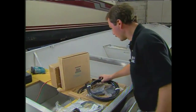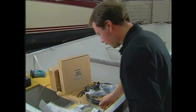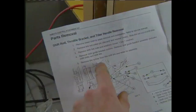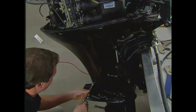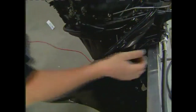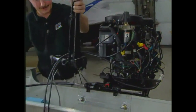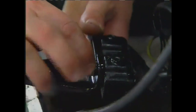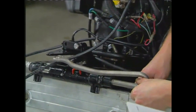You're going to encounter challenges in a project like this, and our first one was converting the outboard from a tiller model to remote steering. We ordered the conversion kits from Mercury and, after consulting the instructions, first removed the cowling to give us easier access to the power head. I removed the old tiller handle and installed the new bracket and connector rod from the engine to the Teleflex steering cable that we'd later connect to the steering wheel on the new helm.